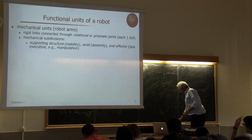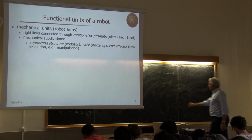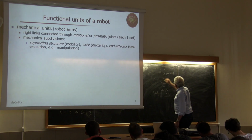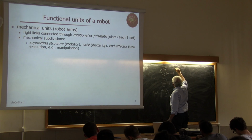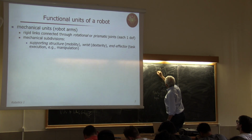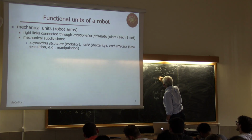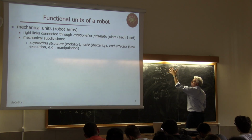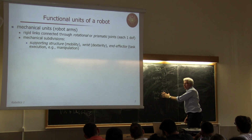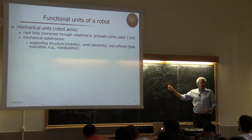And there's an angle theta and a velocity theta dot, saying that we are rotating around this joint, which means that if this joint connects some body with another body, before and after the joint, this body will rotate thanks to the motion of this joint with respect to this body. Okay? There will be only one elementary motion, which is a rotation around the joint axis by a quantity which is specified by this speed. Okay?